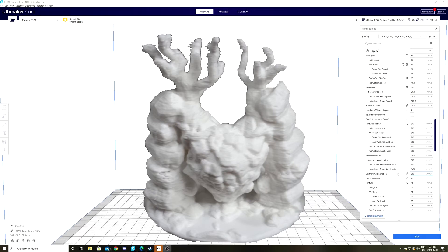Jumping to 80 millimeters a second, we found ourselves a two-hour difference in print speed. So if you're looking to find that happy medium to get a model on your table as quick as possible, I'd say 80 was the biggest jump where you're going to see the print quality be where you want it to be and the print speed be just as good. But at the same time, when it came to painting, there was a degradation in the lines and the details.